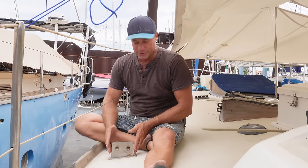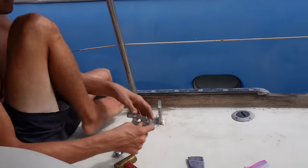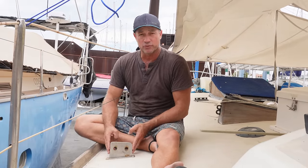We want to say a massive thank you to Memo - we love you mate. We're about to attack our chain plates. Taj has gone around and removed all the screws from our cover plates. We're going to be removing these plates followed by removing the chain plates - it should be a pretty straightforward process. Down below, these are bolted with several bolts holding them. There will probably be more work in accessing all these plates as they're behind covers and behind mirrors. We're not sure of the age or condition of all the plates, but the importance of having these plates structurally sound for blue water sailing is huge - you lose your plate, you lose your rig.